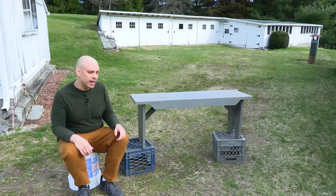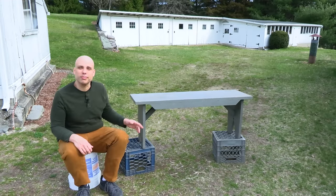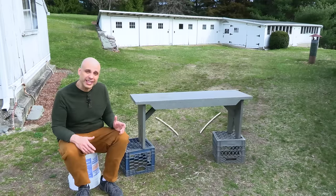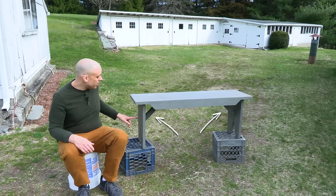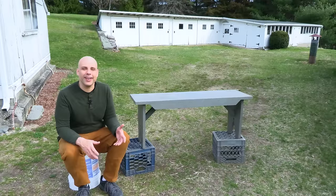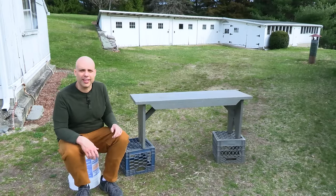This bench is not in that style. Instead of the most efficient, stripped-down, super sturdy five-board construction, it has long legs, a big broad top, and an apron that's not really doing anything. What holds the bench together is a pair of 45-degree braces — small, spindly braces nailed through the top and into the ends. If you showed me a picture of this on paper, I would laugh — those little braces aren't going to hold this big, five-foot-long bench together.